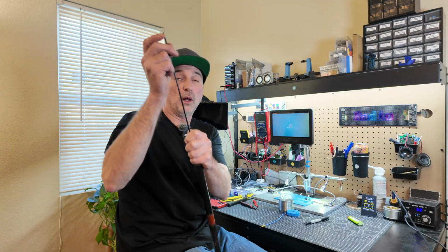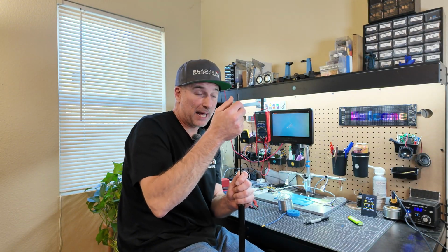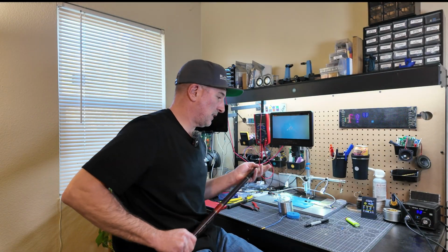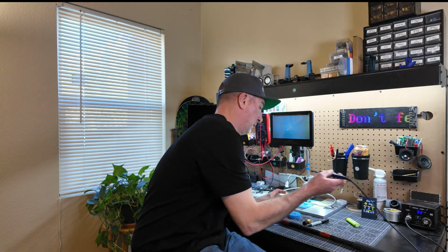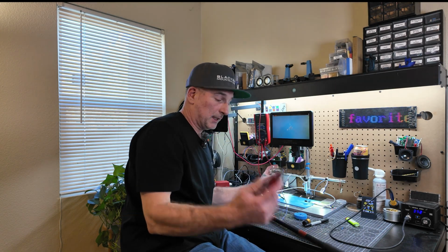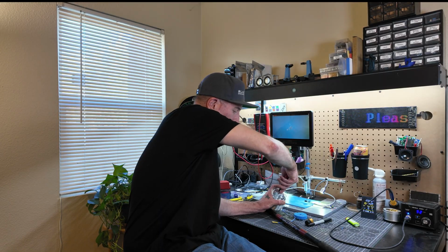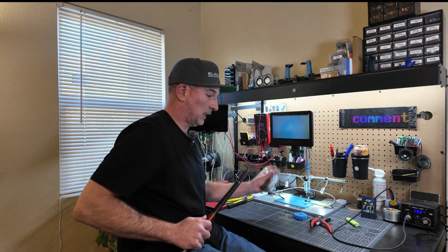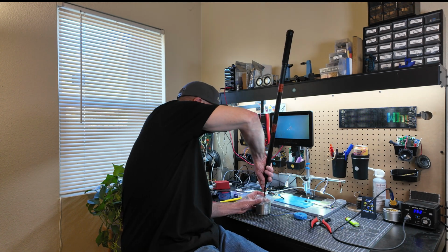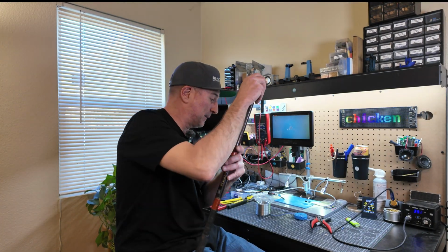So I'm going to need to melt a hole that's big enough for this plastic to slip down to here, but not past the tape. Okay, so I'm going to keep my mast handy so I can try it out here real quick. So I'm just going to dip a hole with my soldering iron once again right down the center of this plastic piece. Okay, while it's still hot, what I'm kind of doing is just taking the tip of my wire cutter and I'm honing out that hole while the plastic is still warm enough to move, and then making that hole a little bit nicer because the soldering iron might not quite do the trick. Okay, so I'm going to go ahead and test this with my mast. Okay, my mast will fit in there, but it's not too big where it won't go over the tape.